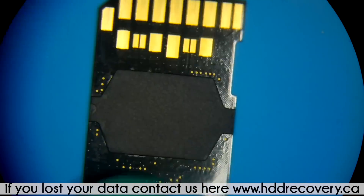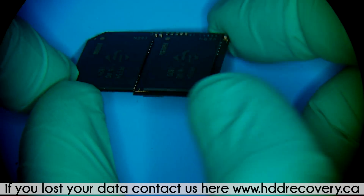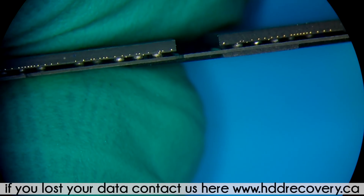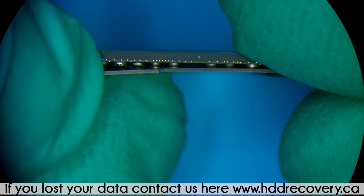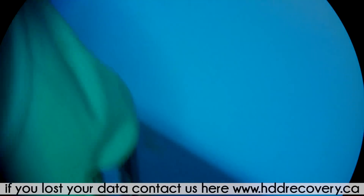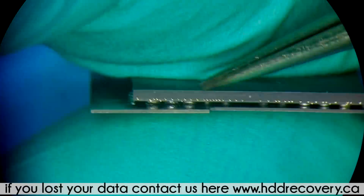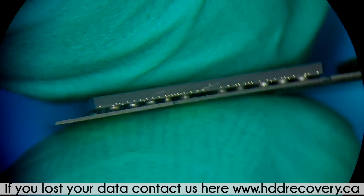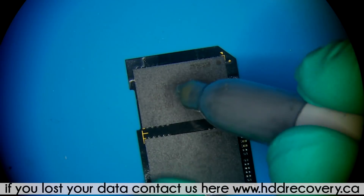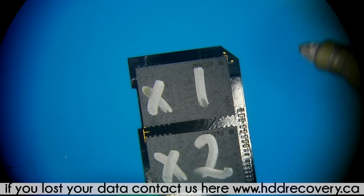There we go. This is definitely the design of Lexar. From the first glimpse I can tell that the problem most likely is due to separation here — if the card gets flexed, due to how flimsy the boards are, these connections just break. The pads on the outside are not very critical, most of the time just ground pads, but if something from the inner grid got separated, those signals are important and may be the cause of the problem. I'm going to mark the damaged unit with an X — chip one and chip two.